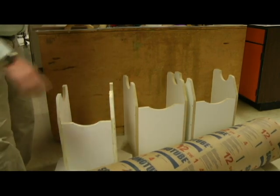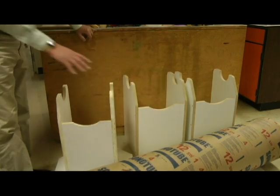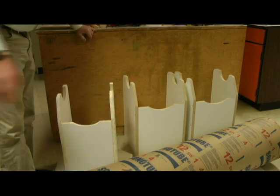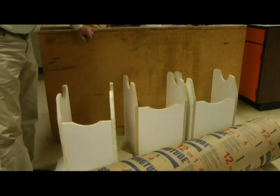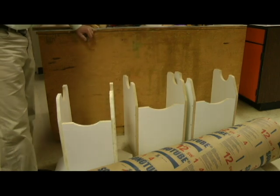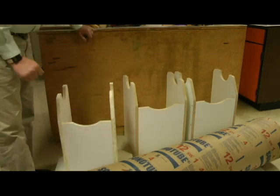We'll also paint the inside of the tube black. Now the insides of these tubes are waxed, so we have to use an alkyd enamel so that it'll hold on. The outside of the tube we'll go ahead and run with a gloss white latex so that we can see them and mount all the hardware going on.